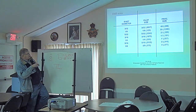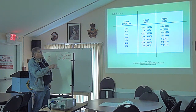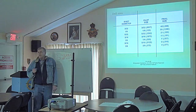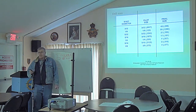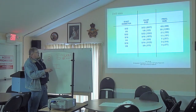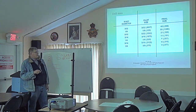Here are the different sizes we're going to deal with. There's the rivet size — this is the pilot size, the size of that rivet. There is the size of the number forty. In this situation we're less than about three-and-a-half thousandths difference between those two. The one-eighth inch drill should be 0.125 in diameter. The drill bit we'll use is 0.1285 — the thickness of a human hair is larger, that's all it comes down to. When we get down into the larger drill bits, we have letter drill bit gauges, and we will get the correct size drill bits.